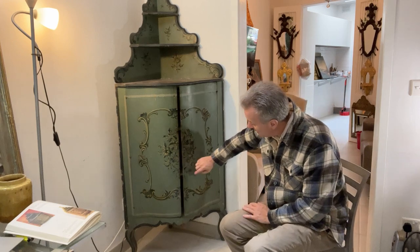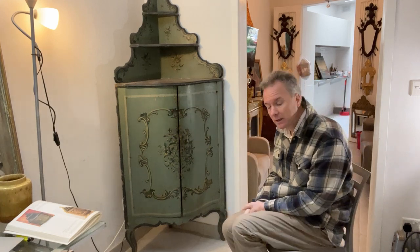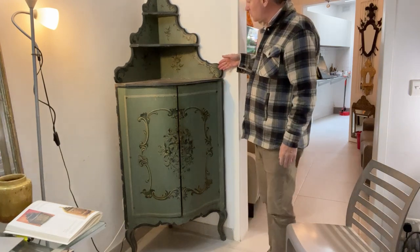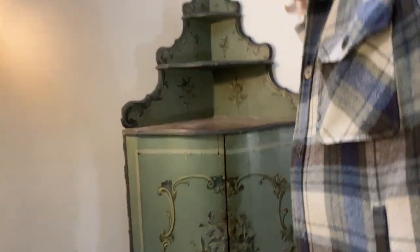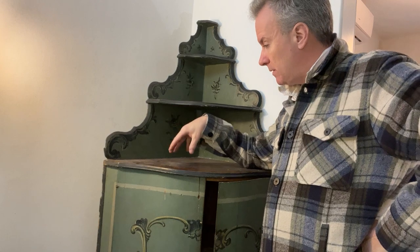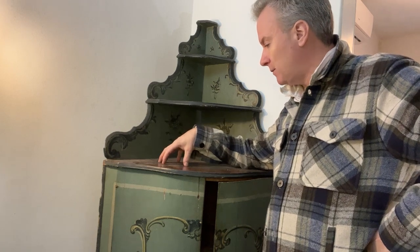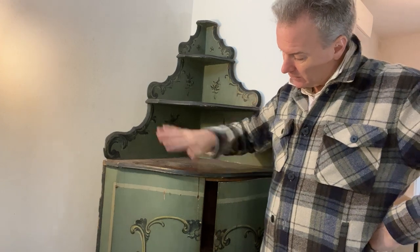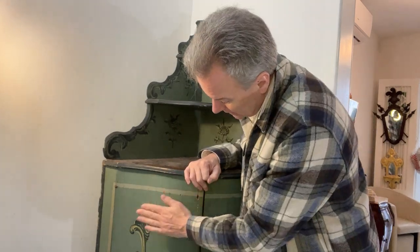It has this beautiful countryside, farmhouse feel — evidently well used. That as a painting, if I went to an auction and saw that on a piece of canvas, that would be worth something just as a painting. The top section has painted scrolls and foliate designs. The top here is painted red — I believe that is a faux marble. The whole carcass was sanded and wiped with gesso to fill the grain and give it a slightly smooth finish. It was then rubbed down — just a piece of screwed up linen would be enough — and then it was painted. So: pine, gesso, paint.